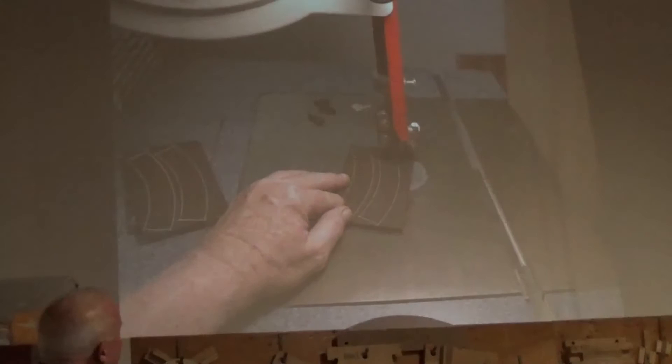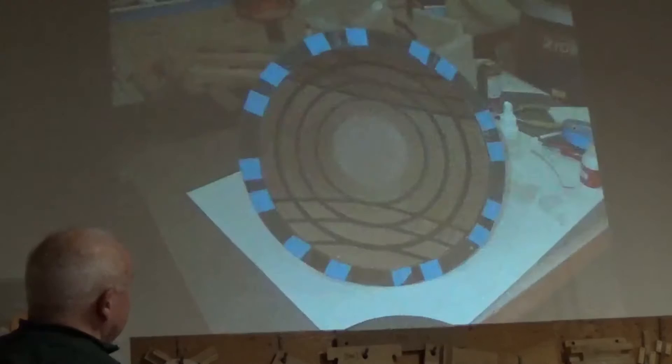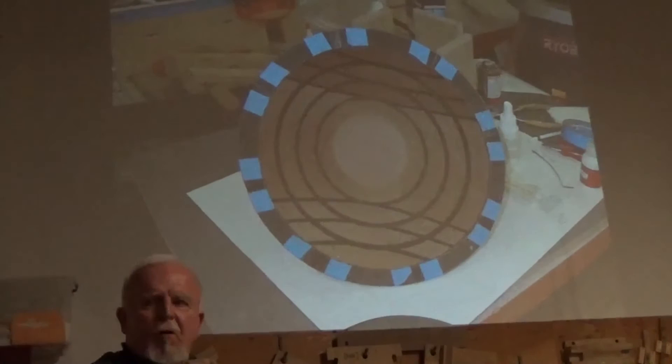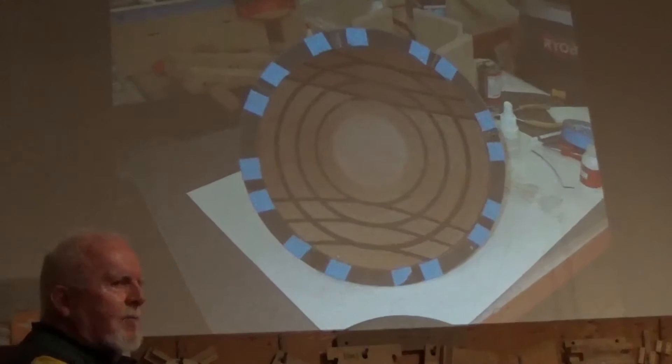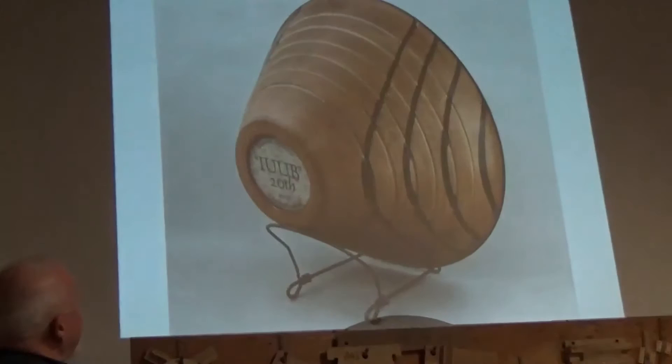I cut the rim out on my bandsaw — I had to be real careful because you've got to match up those edges as it goes around. I got it as close as I could to the template produced by the software. Then I individually epoxied those pieces on using masking tape to hold them in place. The ebony was wider than the bowl was thick so I had some play, and each time I laid a piece down I had to work that joint until it was just right. Fortunately I was careful enough that it all worked. Now I'm turning the rim, and that's the bowl with my seal epoxied in the bottom.